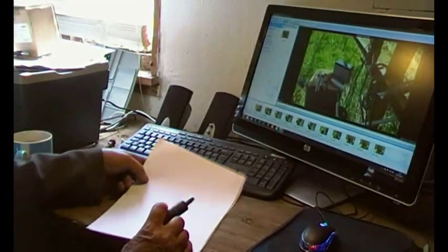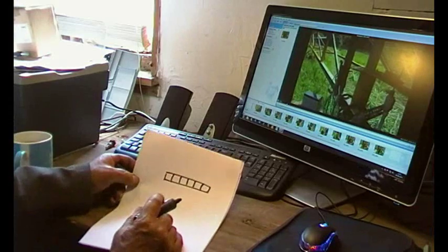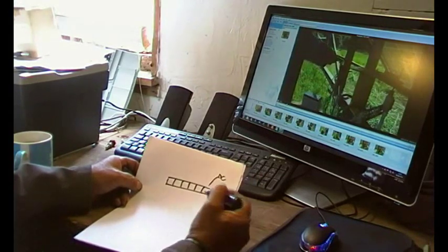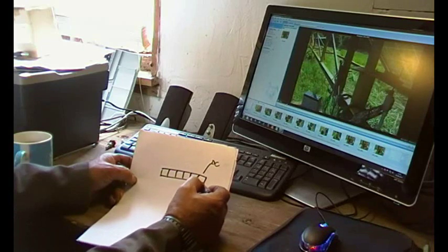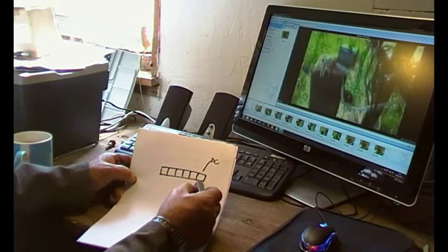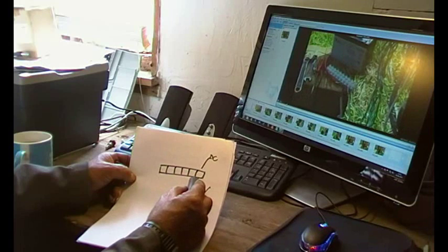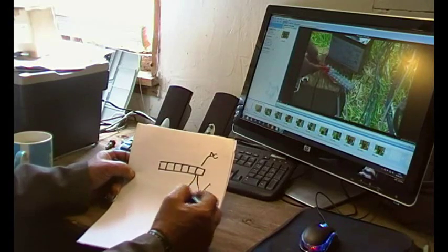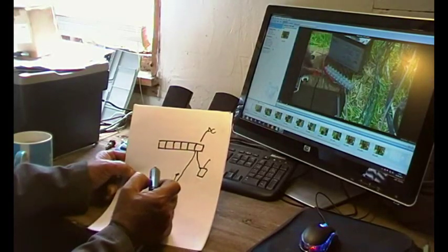Let's draw out the wiring connections — there are six connections. The first is DC in; we can't say positive or negative because it changes with forward and reversing. The DC comes in and goes to both of the stop relays. It comes along here to the relay with the wand on top, and the other goes along to the relay with a little arm on top.